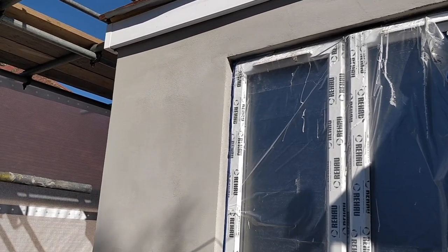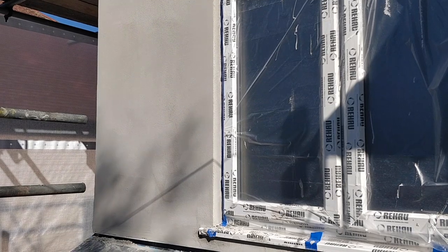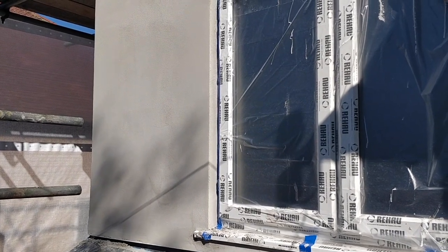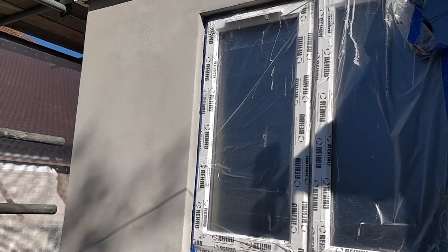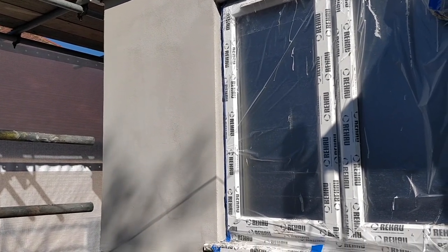To be honest, mate, if that was the finished colour, that wouldn't even look too bad, would it? No. It's a really, really pale grey now. Yeah. What we do is now we give it a light rasp. You rasp over it? Just a light rasp over the top to get the defects out. Yeah. And then we prime it and then we'll go straight back over.